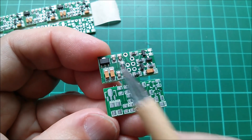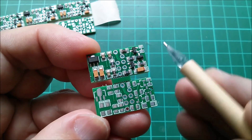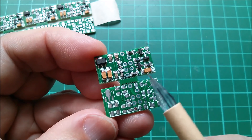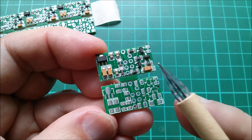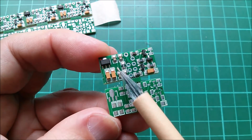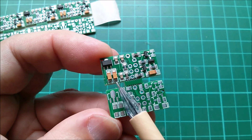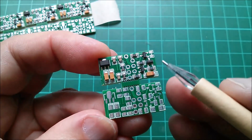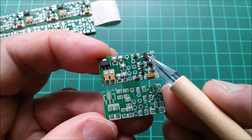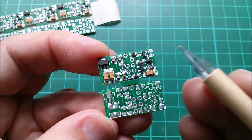Let's go through some of these components. I'm pretty sure the regulator here — which is an HT7550-2 — is an extended component, so there was an additional cost. It says $3 per extended component. The basic components are sitting in their reels mounted on the pick-and-place machines, so no additional work is needed for those. But extended components have to be located and mounted on reels in positions where there are spaces for them. Most of these resistors and perhaps some capacitors are basic components; the regulator and tantalums are extended.